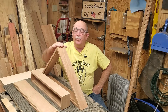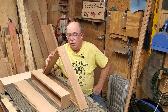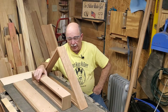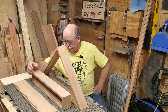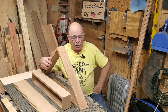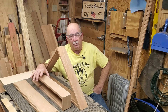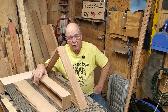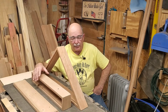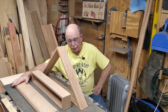Welcome back. Some of the last things I have to do are final sanding up to around 400 grit on everything — I want to get it really glassy smooth and a nice glossy finish. I still need to cut the backer board from plywood and stain it, which is an easy process. I also need to sand the back and front of the cremation box to the right dimensions — the back was a little thick and the front a little thin — so we'll do a lot of sanding to match those up. The base is pretty much ready.